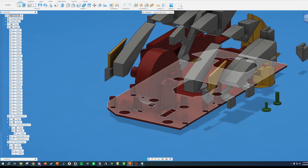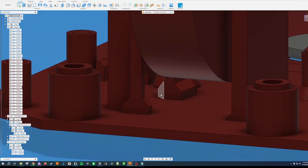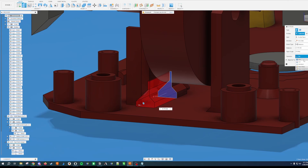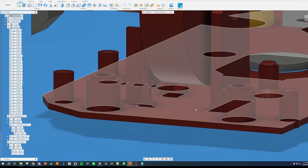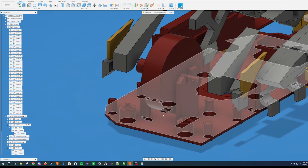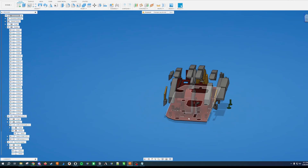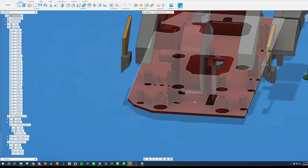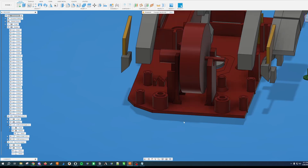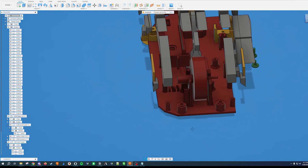I have these little gaps for routing the mod kit wires through. You would normally delete the weird chamfers and pull the geometry through normally. If you want wire routing for the mod kit to go under, that's so the scroll wheel doesn't catch the wires if your mod kit isn't glued or taped 100% in place. If you route wires under the scroll, the scroll could catch them and you'd feel resistance — basically it'd just be bad. It's an unintended thing you'd like to design around.